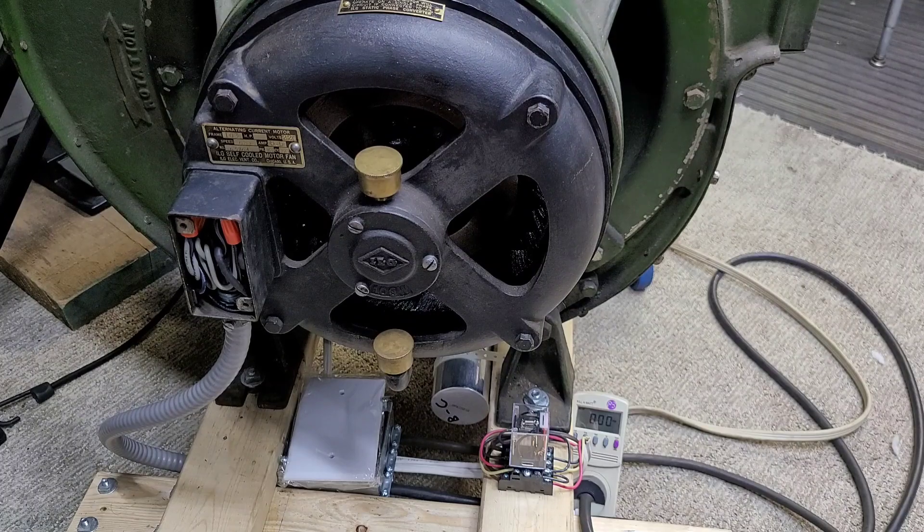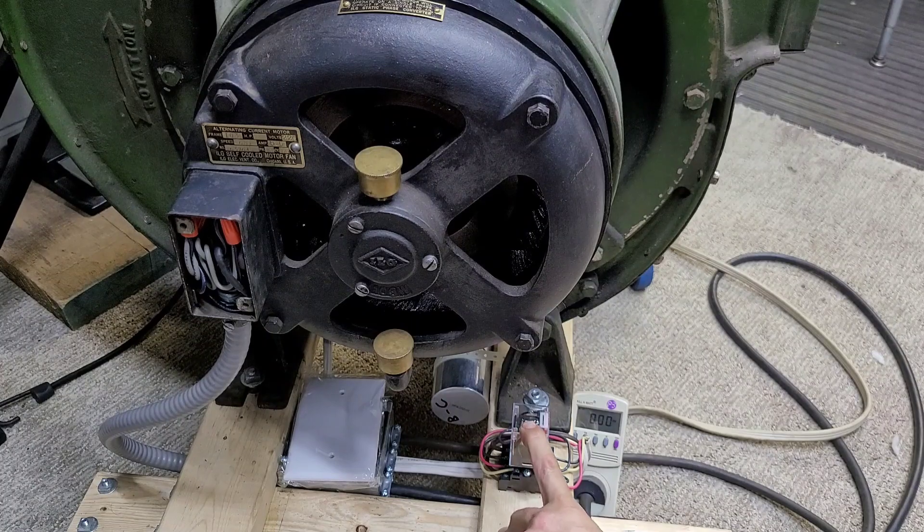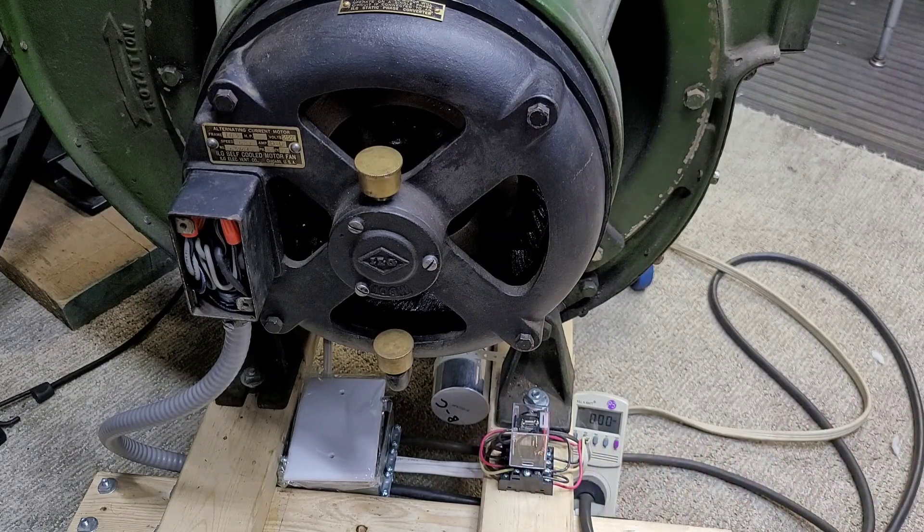So I figured there's definitely something wrong with this relay. I popped it apart, and it turns out that one of the contacts had welded itself together. Now, I am aware that this is not the best thing to be using for this. This relay is rated for 10 amps, which is fine for this motor, but it's really not designed to be having these large capacitor charges go across those contacts like that. I am aware it's not the ideal setup, but it does work for what my needs are, and if it becomes a problem I'll do something different.